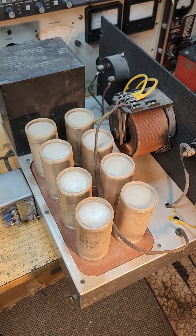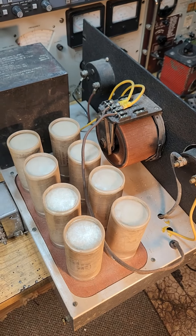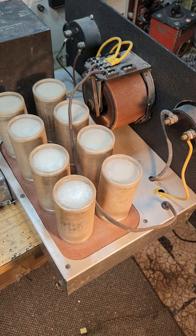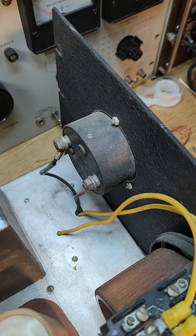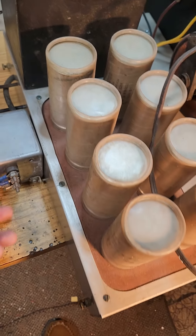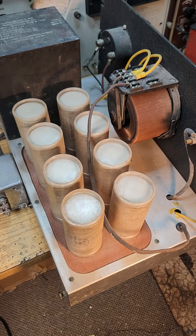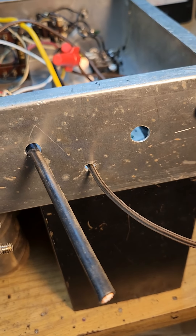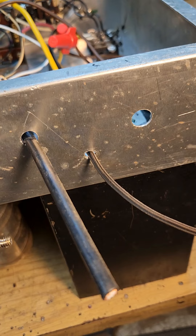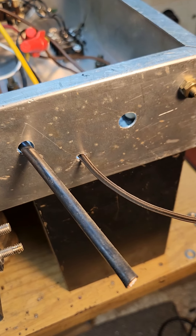But as you can see, everything is aged. There's no better judge of your early work than you at an older age, and I can see lots of problems where I've screwed up. There's no grommets on those — look at these wires coming right through the chassis. These are all brittle. Even the AC wires are brittle. This is a horrible condition. It's a miracle it lasted this long without burning down the house. Bringing high voltage leads through bare holes in the chassis? That's not a very good idea.